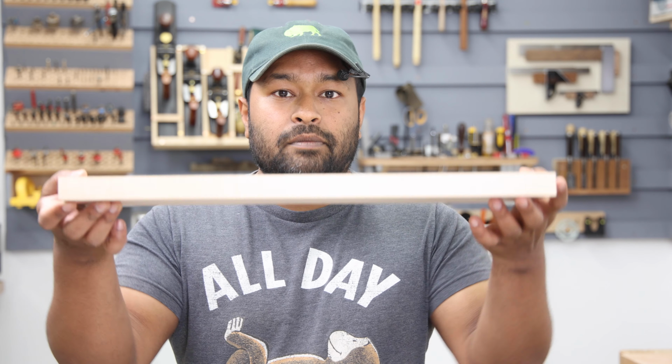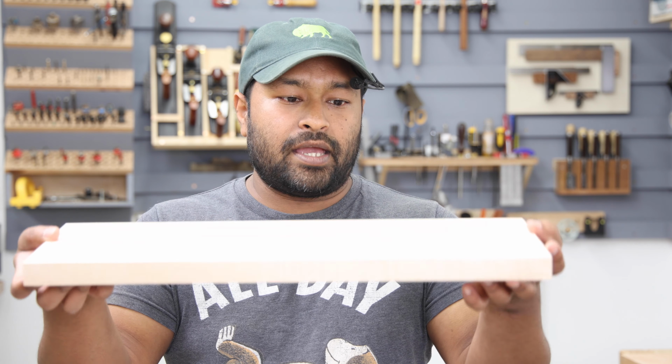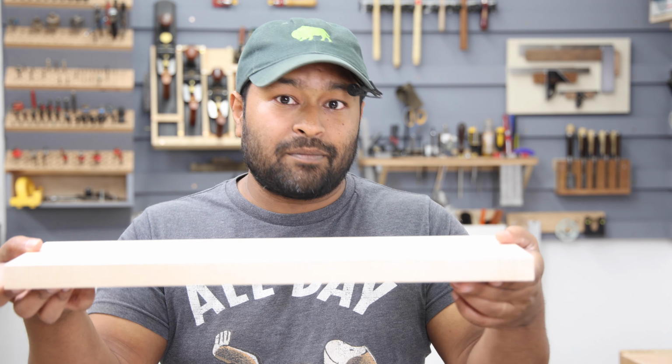In that spirit, the material that I always go for is 4/4 inch, of course, rough cut material, and I always mill it down to 7/8 inch, because from 4/4 to 7/8 you usually get them to be flat and square without too much loss of material. But even if it's a little bit warped, you can still get it down to 7/8 without a problem. So that's the first thing when it comes to standardization.